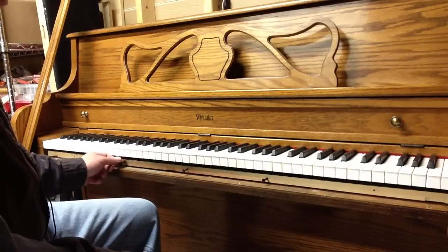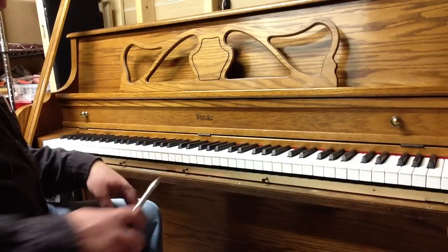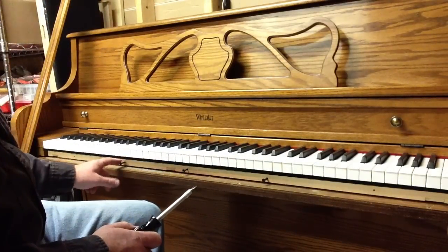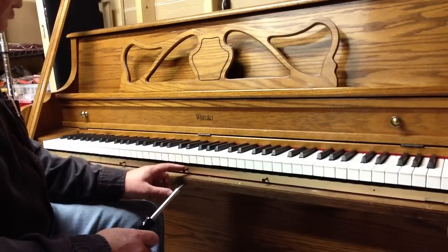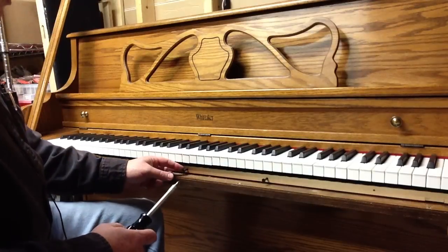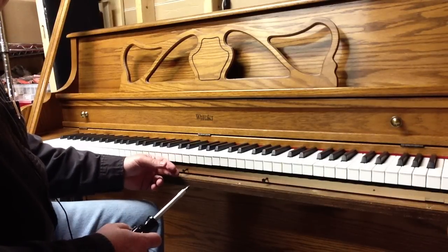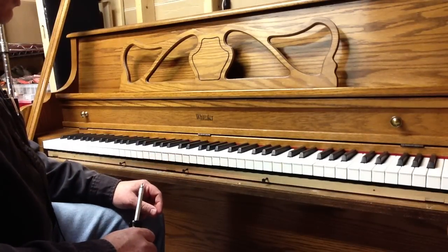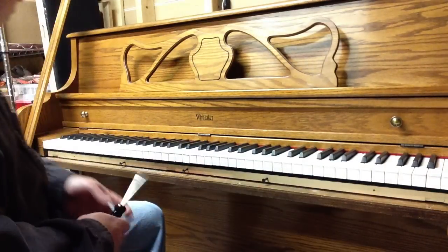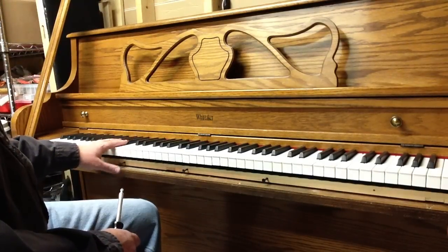Okay, now in some pianos, including this one, it has adjusting screws that makes it really simple to shim the key slip out. Now this one has 3 screws for different sections. Say if it's sticking here in the middle, and you just have to adjust the one in the middle, you can turn that, and by turning it out, that will pull the head of the screw so it's further out, which will essentially push the key slip out just a slight amount so that it's further away from the keys so that they won't bind. This one has 3 screws. There actually were 5. Here's a screw hole here and a screw hole down here that had screws in them, but that's really not an issue in this one.